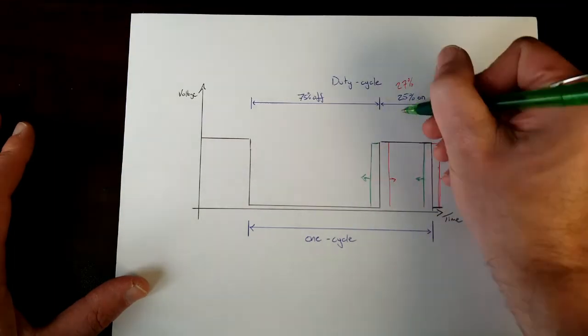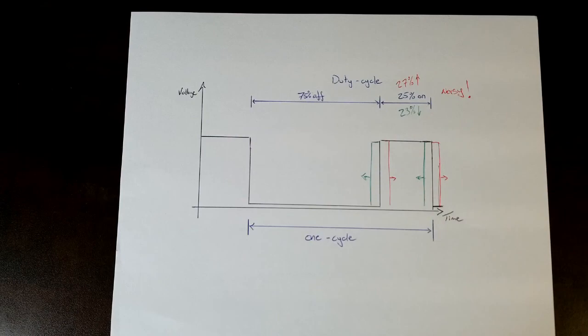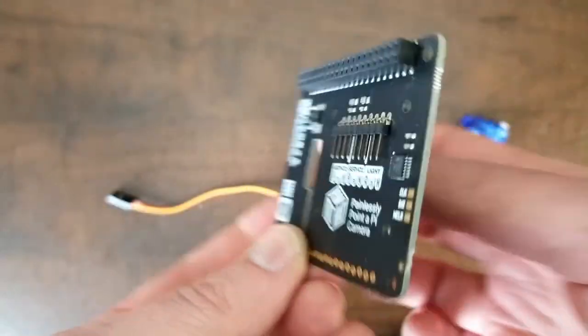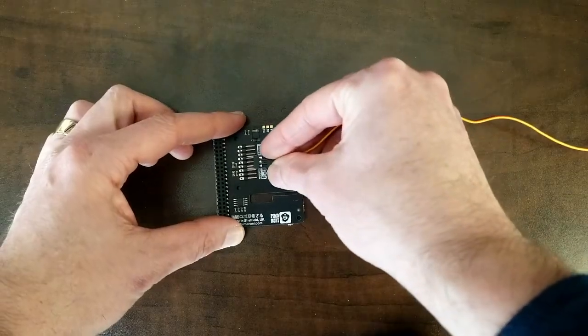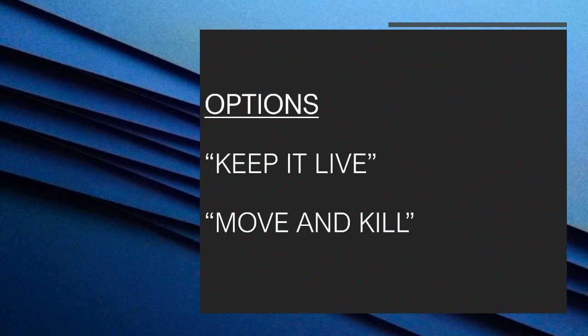To fix it, that means we have two choices. We need to redesign the controller — I could use this handy hat I have laying around, but that would consume a lot of output ports, and for this project we will need more ports, so I'd really like to not do that. Or we change the way we control the servo.